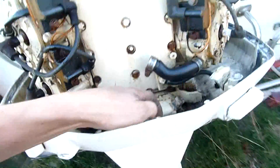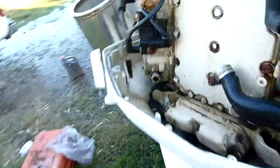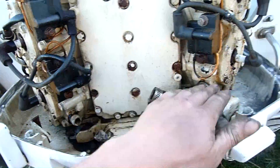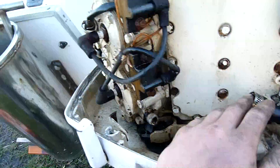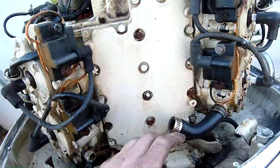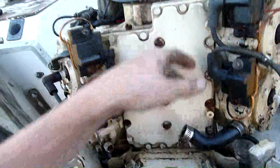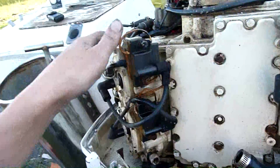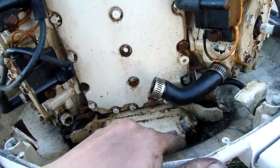It's quite evil inside. Just general information on this engine — it idles and runs superbly, it's just having cooling issues at the moment. With these hoses off I get water spewing out both heads and the telltale quite nicely. With the hoses on, this head gets cooling but the telltale and everything else seems to airlock. I'm guessing this exhaust cover is divided and you've got inlet water getting preheated and going to the cylinder heads, but this side is just staying under airlock because there's very little or no flow.